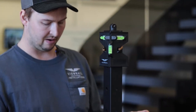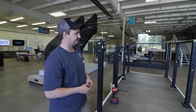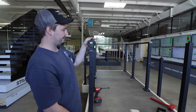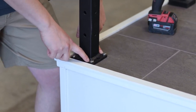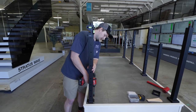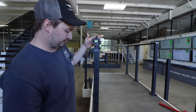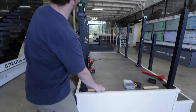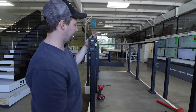There's no point in unscrewing all four holes at once — that's just harder in my experience. I'm going to start with this side. My post needs to go this way for the bubble to come back. Because I need the post to shift this direction, I'll loosen up these two screws and shim. I'm going to shim it a little bit past where it needs to go, so that when I drive it down, the shim compresses slightly and brings me to level.